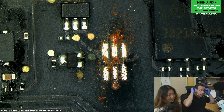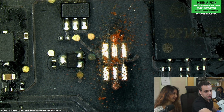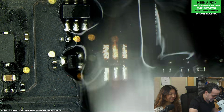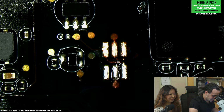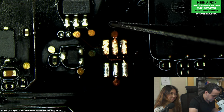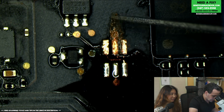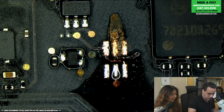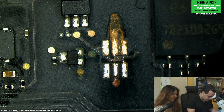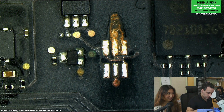I should have a link to an X-Acto knife in the description that's similar to that one. So now, after that's done, all our scraping is done, now it's time for our cleaning. Okay. Now my main concern is, the pad may be okay, but is the via that's feeding it good? It doesn't seem like that's any good. So I gotta figure out what that goes to later. Okay. Some flux.